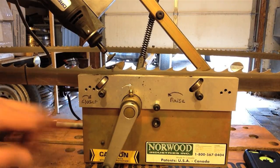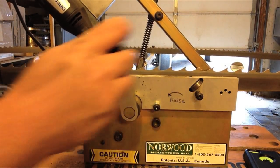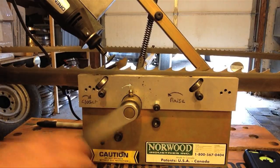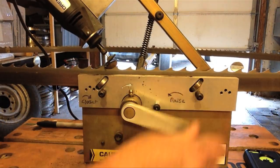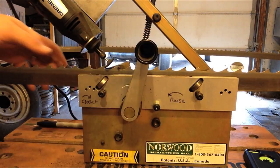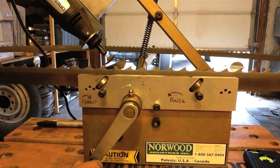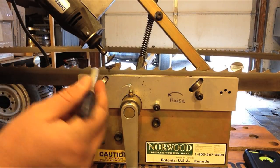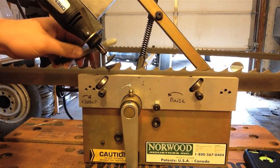We're going to turn it counterclockwise because we want it to get further away — one, two, three. That's all it takes. Now you can see it's clearing that tooth by about an eighth of an inch. Same thing up here: one, two, three to drop it down. Now we're going to start it and slowly let it down until it makes good contact. I'm probably a little too far, so I'm going to move a little closer to the front of the teeth. The idea here is that we want to get the entire gully — we want it to strike right about here and grind all the way up the back of the tooth and off the tip of the tooth.